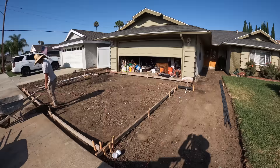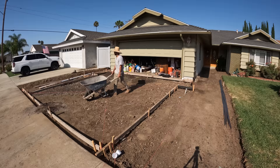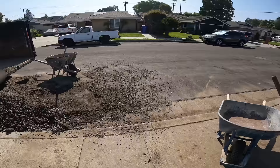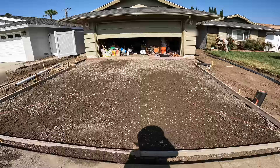You can see we compacted all of our sub-base. After that, we brought in road base - since I dug extra down for the pavers, I figured I might as well bring in nice road base for the driveway too. Just like that, the driveway is already graded, though it took a lot more base than I was expecting, so we had to do another base run. Shane's getting the hose set up - I'm going to spray it down and compact. Once it feels nice and stiff, we'll throw our rebar in, two feet on centers.